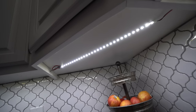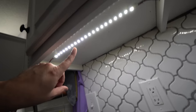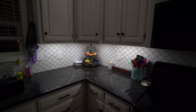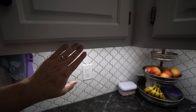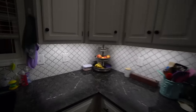On this style of cabinet I went ahead and put the LED strip at an angle. I would definitely recommend wiring one up and playing around with the position first, because the position of the LED strip and the depth of the cabinet do matter for how much light it outputs. The closer you get to the front edge, the more light it puts out — but if you get too close, it shields and cuts off the light. So there's a happy medium; just play around with it.